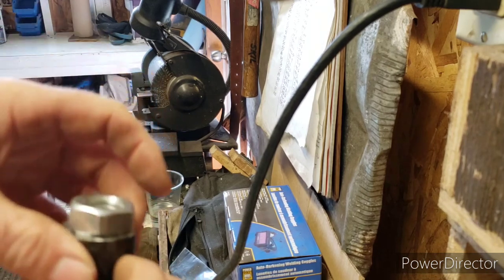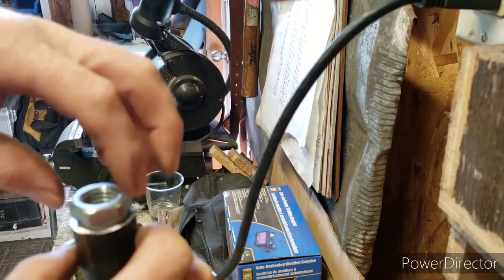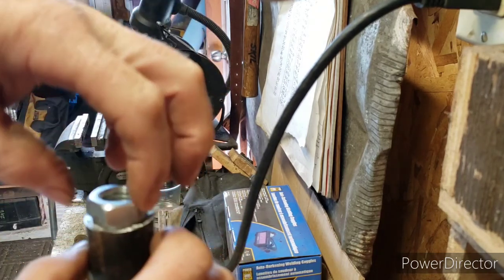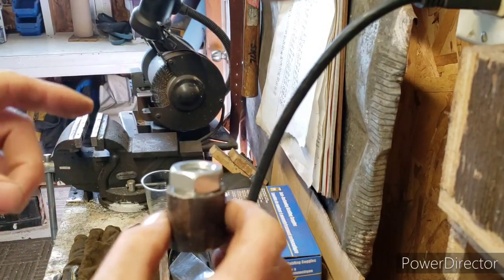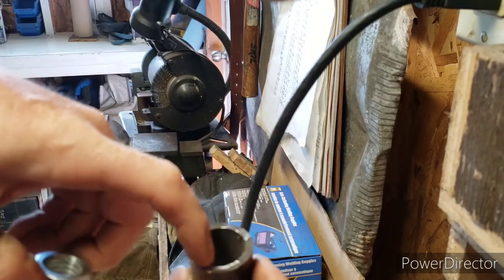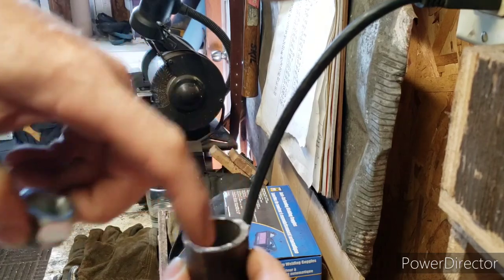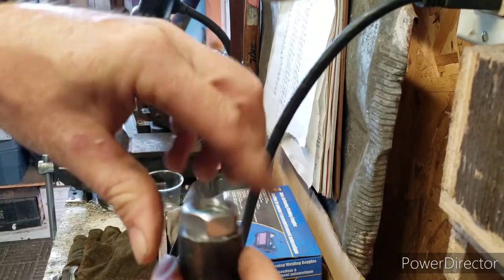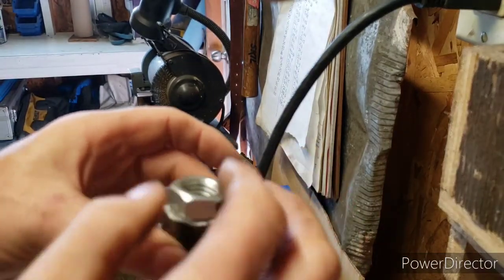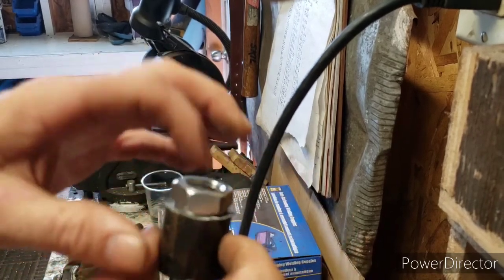This rod - I'm going to somehow see if I can, maybe, before I put the top nut on, I'll get a piece of angle iron, cut a hole in it roughly the same size as this, weld that onto this here, then put the nut on and weld the nut on to the angle iron, and then weld and fill it all the way in with weld.